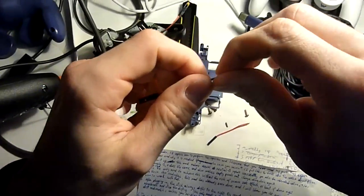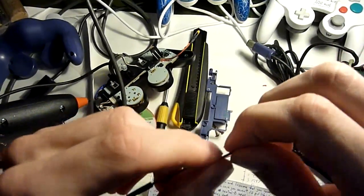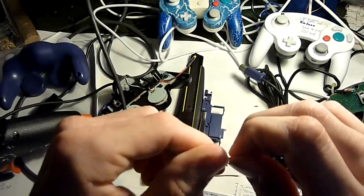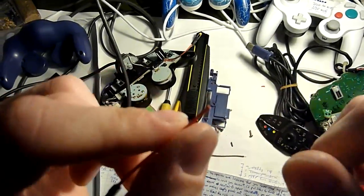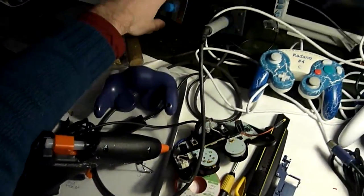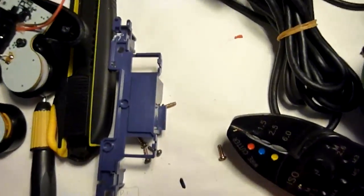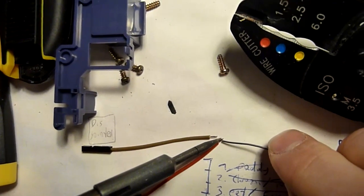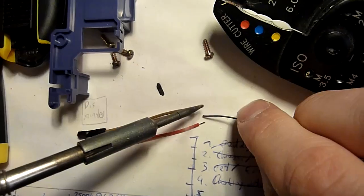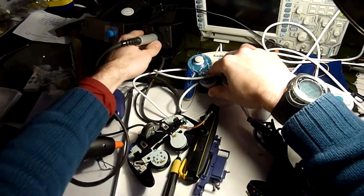And afterwards we twirl the copper threads together and stabilize them with solder so that the individual threads don't stand off from the main branch and make contact to a different pin on the PCB, which would cause problems with misinputs and drifting even. Okay, after you've twirled them a bit, you just put them here, and by now our soldering iron is heated up, and we use the solder to put a bit of solder to the ends, just so that they have a light solder coating and the threads stay together. Then we put the soldering iron away again for now.